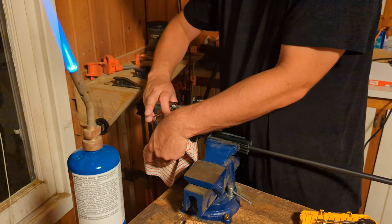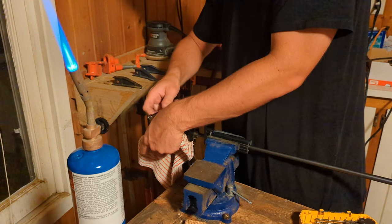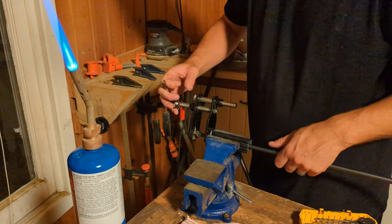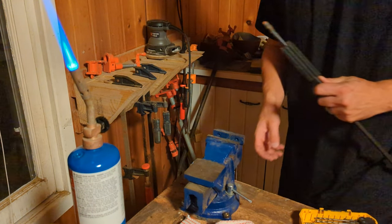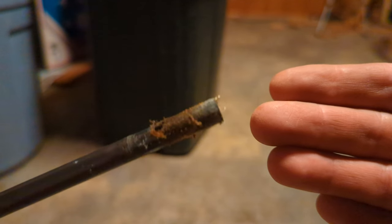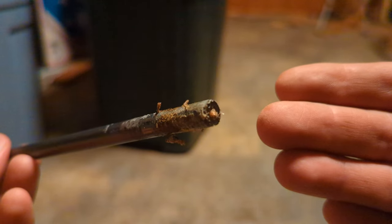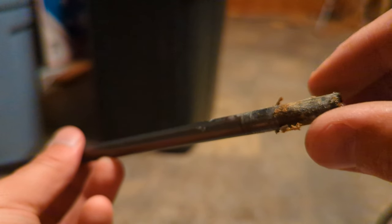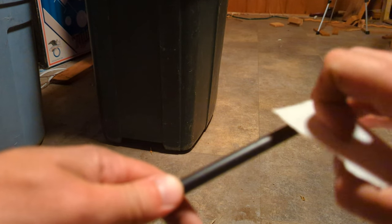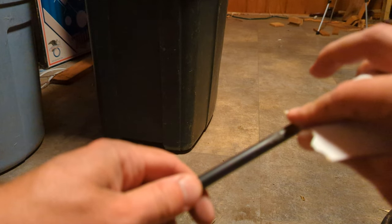The more I used this device, the better and cleaner it gets as you build coordination. There we've got the head come off. Now let's look at the quality of the shaft. This is the graphite shaft I just pulled — it's got some glue residue on it, but the main thing to check is the very end where the graphite is, to see if it's starting to fray. Too much heat during extraction can damage the graphite. I'm even touching it right after pulling it and it's not terribly hot. I hit it with a little sandpaper to remove the glue residue and was left with a really clean pull.